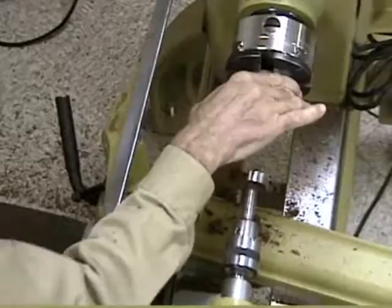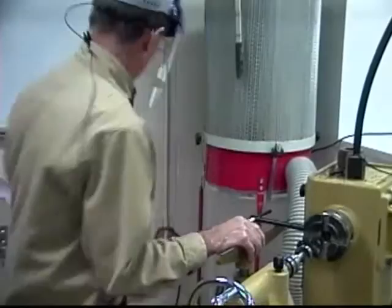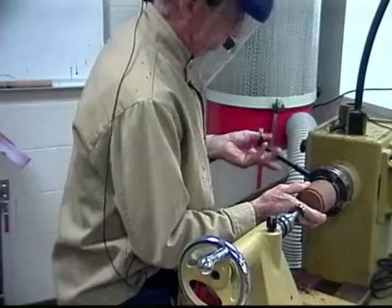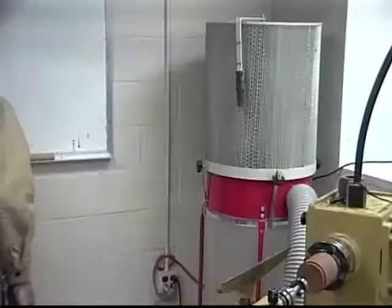So that's a quarter inch deep and just an inch and a half diameter. Bottom gets an inch and a half on both ends. The bottom end is 5/8 deep because that's where your grinder mechanism is, and you could go just a tad over that. And I didn't throw my little ruler in there, so.